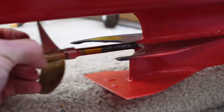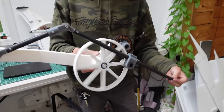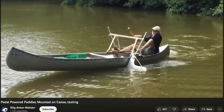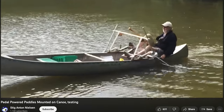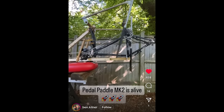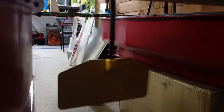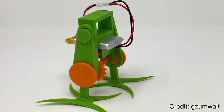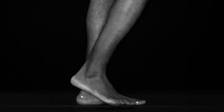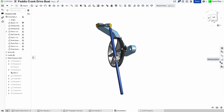After that I headed back home and removed the old drivetrain. The first alternative propulsion method I'm going to try out is a linkage driven paddle. I got this idea after seeing some other online videos of people trying this out. It looked pretty weed proof and efficient. This mechanism has an advantage over regular old paddle wheels because the path that the paddle takes through the water is more effective. The geometry can also be adjusted to fine tune the paddle's entrance and exit out of the water to minimize drag. I kind of think about it like a paddle wheel being compared to a highly inefficient walking gait, and the linkage mechanism being more like a proper human walking gait. I drew up this model in Onshape that converts a rotary motion from a low KV brushless motor into the paddling motion.